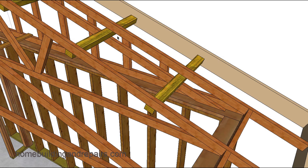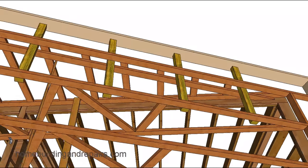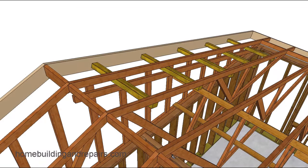But this will be the key to the repair. If the weight pushes this down, it's going to put weight here and force this up — so that could actually be a problem. You might need to go back to two trusses or a few more trusses. Keep in mind these trusses might not be designed to support that type of weight, especially if the overhang gets a little larger than 18 to 24 inches.